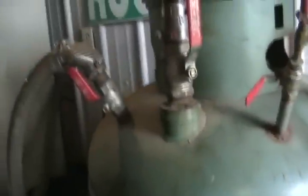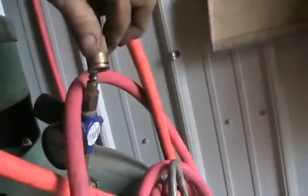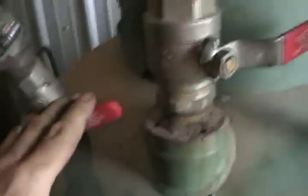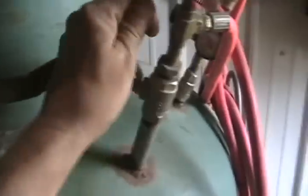If you wanted to use this system once it's full of water, it doesn't matter which one you shut off first — just shut off the two that go outside. It works off compressed air coming in, right here. It also gives you a handy compressed air connection in case you want to do some painting or blowing inside your room when cleaning. It's got an ordinary pressure regulator like you might have in your shop. If those two are closed, you allow compressed air to go in and open this valve.